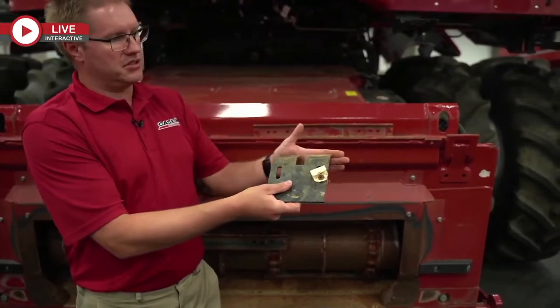At the same time, up here, there is also a slip joint up underneath this cover — you can probably get it from the bottom easier. We took off this cover to try to illustrate it but it didn't really help. That, again, is 300 hours — basically once a year, just give it four or five good shots. In here there are two pillow blocks for the shaft support; those are important to get a couple shots every 100 hours.